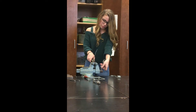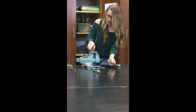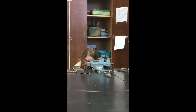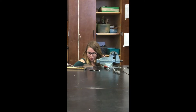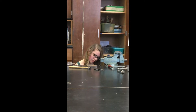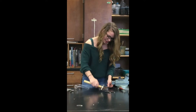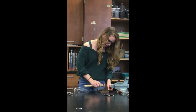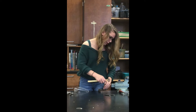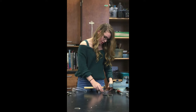Why wouldn't you want to hit it hot? I like to hold it. If you want to hit it hot, you'd ideally need a double-sided block here. I like to hold it — it's still warm when you take it out. If you have gloves or something you can, but it's safer this way, you don't ruin anything. There's still plenty of softness. The big point of doing that — not only does it make it easier, but once copper gets hard, it breaks. So you've got to make sure you don't do that.